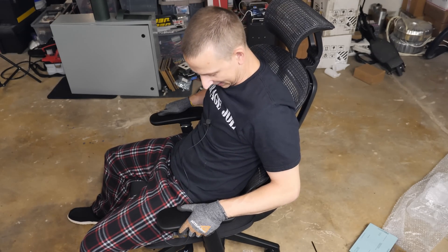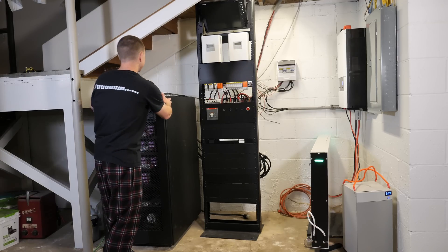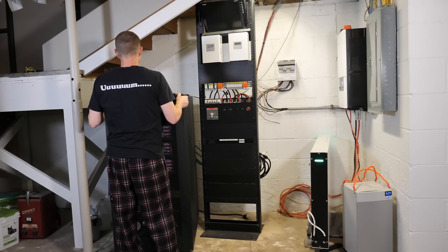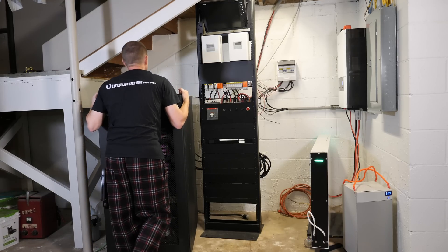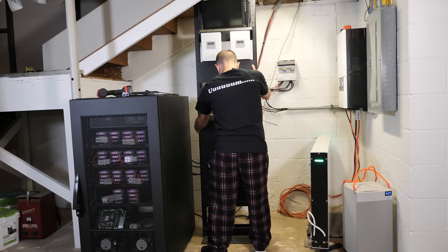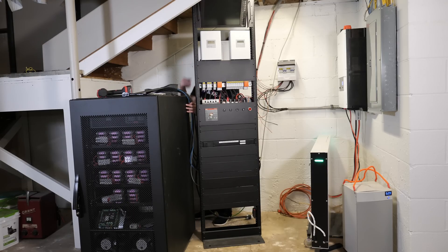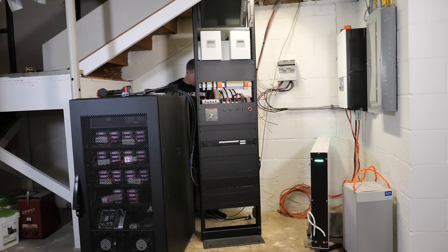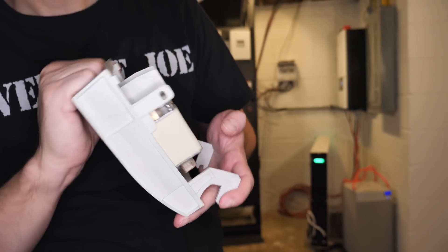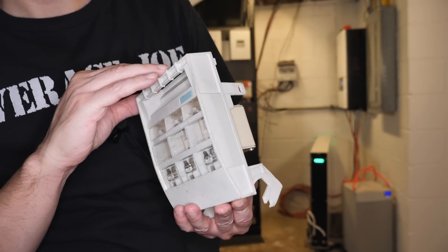New ergo chair — now I can sit. Did you guys know this is technically a mobile Powerwall? Because this server rack is on wheels and I can move it around pretty much anywhere, like away from the wall. I need to get to the back side of the Powerwall and I'm going to pull the fuses — just so there's no power up here. Fuses are pulled. Here's what I have in the back — just those blade-style fuses which you just pull down and it disconnects. I just want to make sure all the power is disconnected before I start touching things.